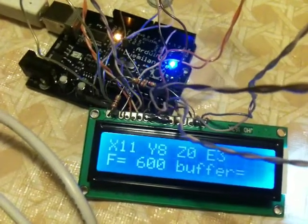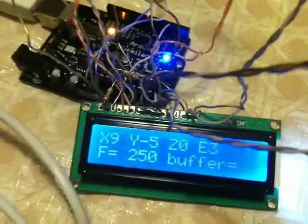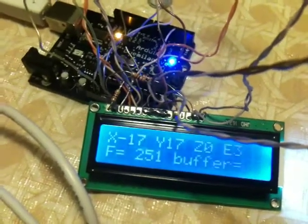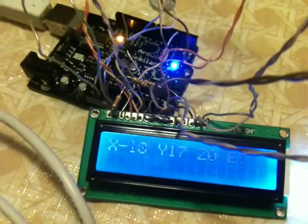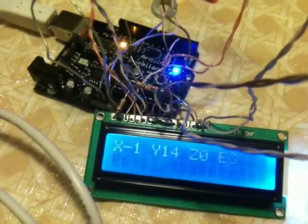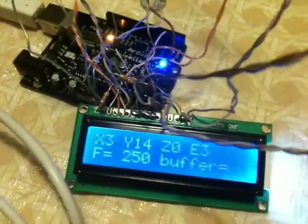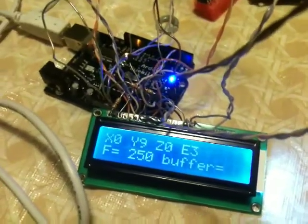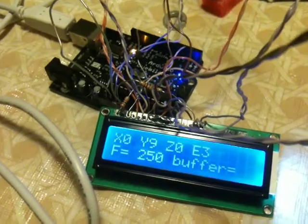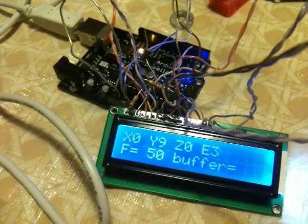Right now when you send a message to the Arduino, you need to accept it and say you got the message and it's good. That turnaround time is what makes things so slow, even with fast communication. If you can send information and have the Arduino fix any corruption right there, then that's much faster. Anyway, I thought you guys might want to see that LCD support is coming. This is the 4-bit LCD driver from the driver library for the Arduino.